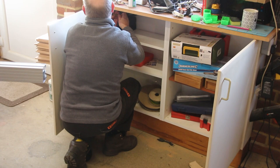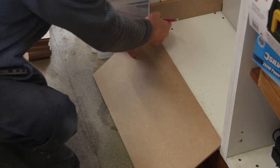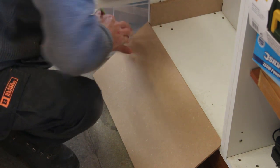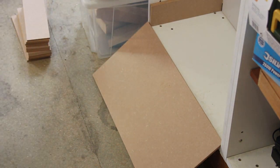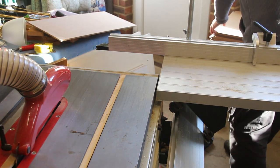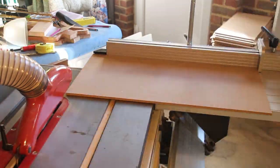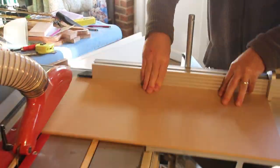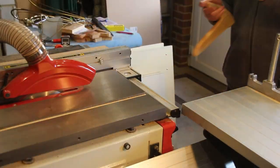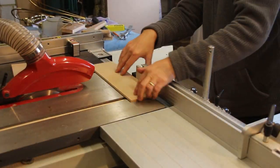I no longer need the doors on these cupboards so I'll take them off. At the bottom of these cupboards will be two boxes. The length of these boxes is the internal dimension of the cupboard minus two thicknesses of the board plus a little wiggle room. So I'm going to mark where the thickness of the board is and then use the kerf of the blade to give me the wiggle room, which would be about three millimeters. With the board in place I set my flag stop so I can cut the next board exactly the same. I do the same for the remainder of the boards but these are one board thickness longer than the previous two. I cut four pieces at a hundred millimeters wide — these will make the fronts and backs of the box and will go at the bottom of the cupboard. I cut the sides of the boxes to length.